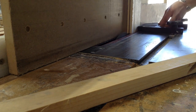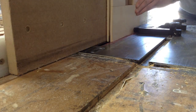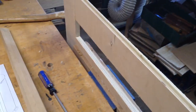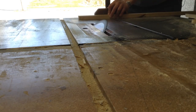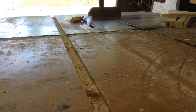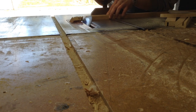I'm doing the top groove as well, so I'll have a consistent groove on both the pieces I'm joining and the surface itself. The spline will sit in there and make for a really solid connection. The bottom edge sits flush — it doesn't go below the bottom of the base — and there'll be a lip on the inner edge to hide the bottom part of the cabinet. To attach the molding I cut one miter, put it on the piece, make a mark, then cut the other. The sides have no molding at the back, so I just leave them long.